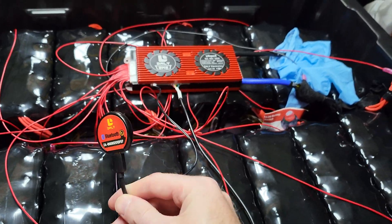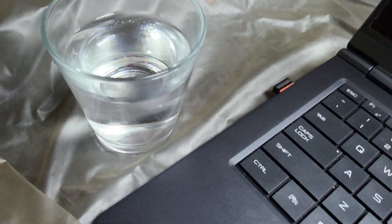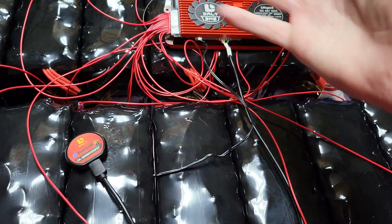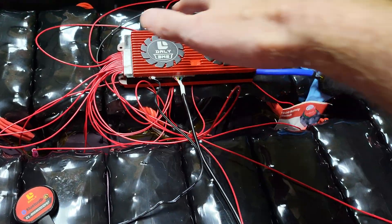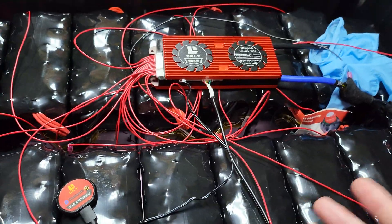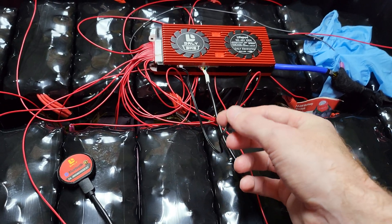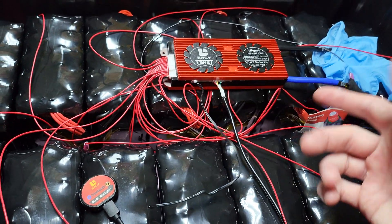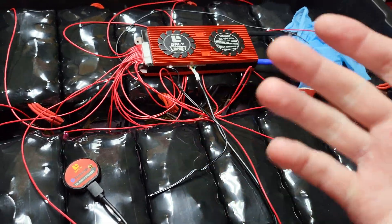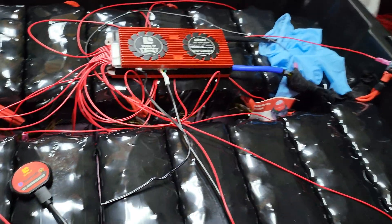What I did last night is I tested this using the old trick of a glass of water with some ice. I changed the temperature settings, doused it, and it did absolutely cut off the charge, then cut off the discharge, and the app confirmed it worked. You need to change the settings to get it to work, otherwise it's set to something way lower than makes sense — or way higher for the high temperature cutoff. It had like 60 degrees Celsius, which seems ridiculously hot and inappropriate.